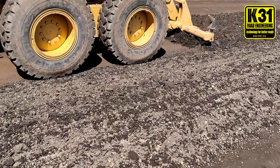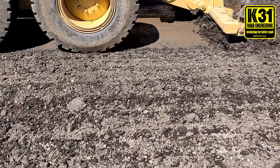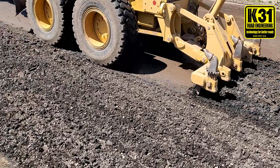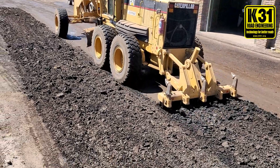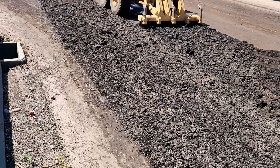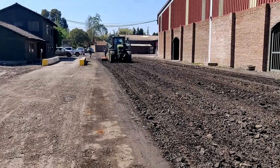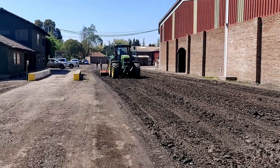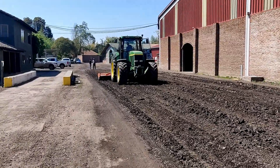70 to 75 percent of building a road using soil stabilization will be spent on the prepping of the soil — opening the soil, and if a portion has really bad soil or you need to raise the level, bringing in laterite and incorporating it. Most of your time is spent prepping the road before you even stabilize. The stabilization part is maybe 20-25 percent of the work.